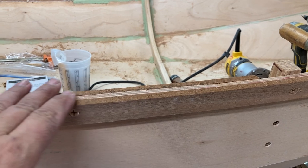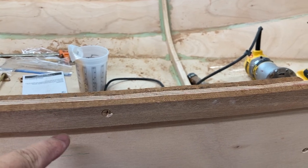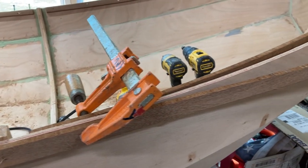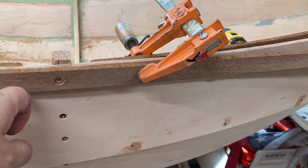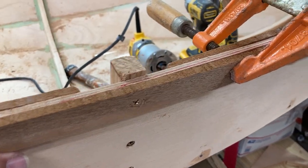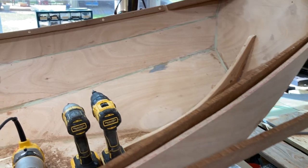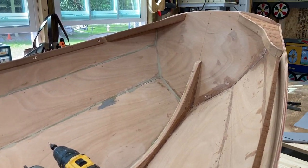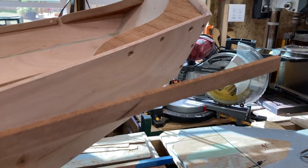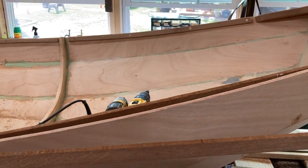Next is to get these three pieces of wood level-sanded, routed on the edges, and do some light finish sanding — 60 grit, then work it to 120 by hand. The gunnel will be finished bright; it's sapele mahogany and it's going to look beautiful. Beneath it will be painted sheer strakes. For colors we're still contemplating, but we're looking at Kingston Gray on the inside and Kingston Gray on the outside of the bow transoms. We may even do something a third of the way up — you'll have to keep your eyes peeled.